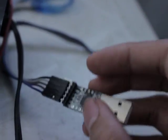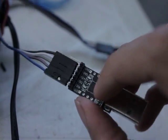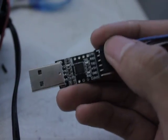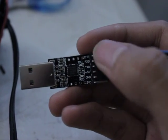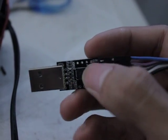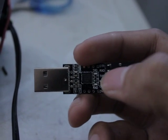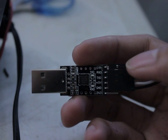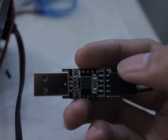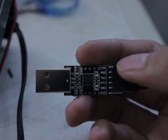It's really great because they updated the hardware. Instead of attaching another pin for the auto-reset or the DTR, the DTR pins are already placed at the back end instead of the middle — which is where users used to add a pin to make the Arduino Pro Mini programmable and auto-reset before programming.